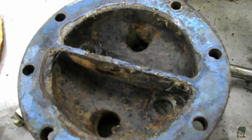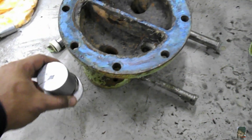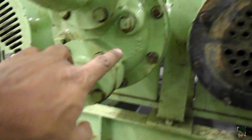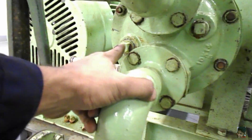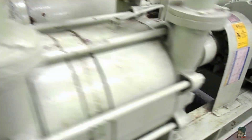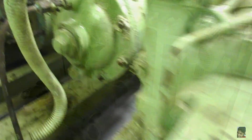As you can see, the anodes are of different sizes due to the location where they're installed. The two smaller ones are from these two pockets — this is what it looks like when installed and in use. The bigger one is from here, and right next to it is how it looks when in operation. It is important to remember that all the gaskets and jointing should be renewed so as to avoid what's called a double job later on.